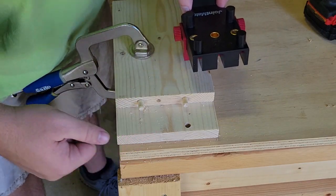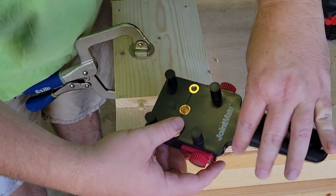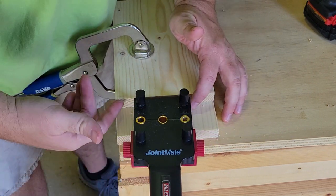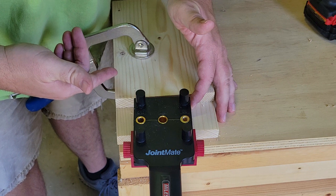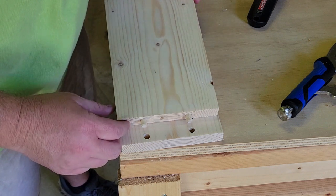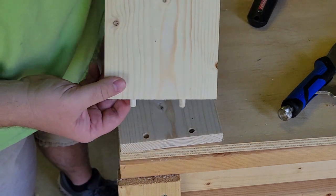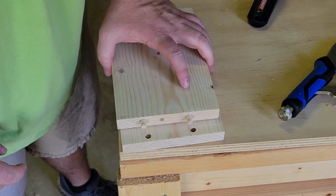Step 15 is just repeating steps 13 and 14 on down the board, but I did learn something about spacing. If I try to line this slot up with my second dowel, it won't go — I didn't leave enough space. So as you're laying out your dowels on board one, make sure you have enough space to get the jig in between the dowels. We've made it to step 16. To fix my spacing issue, I just pulled one dowel out and made my second hole. Do a dry fit before you put any glue just to be sure. Looking pretty good. Then just pull the dowels back out, put glue there and in there, let it set up, and you're good to go for corner.